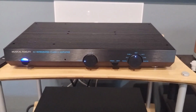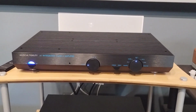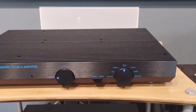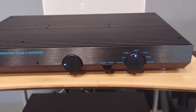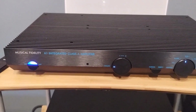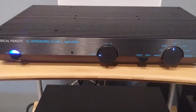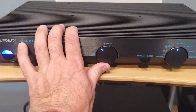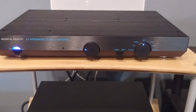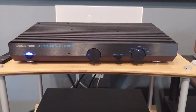It's sort of the only negative to Class A amplification. It's inefficient. It does waste a lot of energy as heat. But this amp does not consume a tremendous amount. According to our spec sheet, maximum consumption is 130 watts of energy. I'm sure that's at full output too. And every speaker I've been running on here, I barely get over the 9 o'clock position. When I start getting up into the 10, 11 o'clock volume position, it is really loud. Most of the speakers I'm running on here are, of course, simple two-ways that are not super hungry.